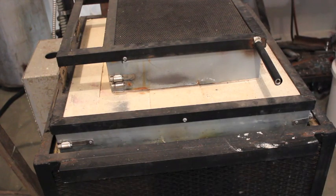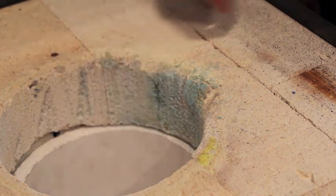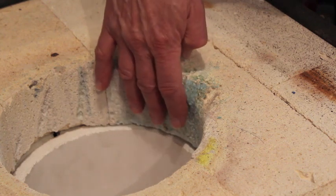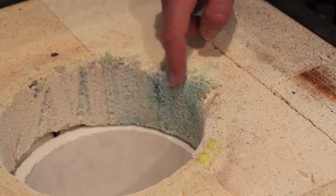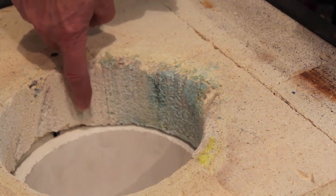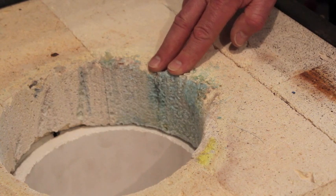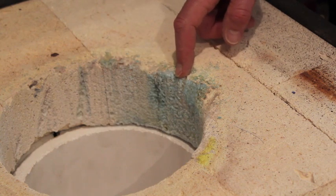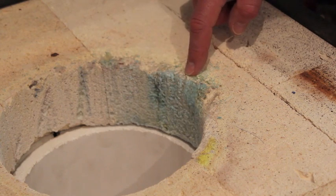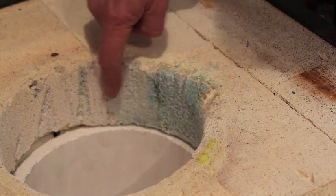All right, we're done. There's a bit more erosion in the gathering area. I'm right-handed, so most of the thin stringers that come off the pot are on the right-hand side of center. Most of them are very thin — as thin as a hair — but there have been a couple of thicker ones that actually have enough fluxing material in them to start eroding into the soft brick. That's not bad, considering I calculated I've taken around 22,000 to 23,000 gathers from this furnace since I built it, and I'm still on the original bricks.